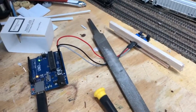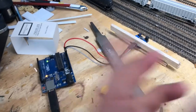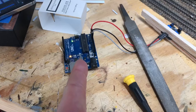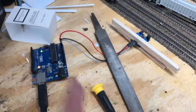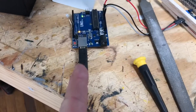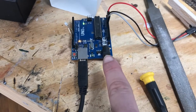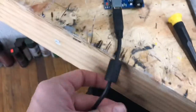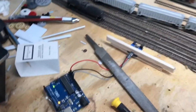That's the end of this video. The next video will be once I've mounted the sensor in the hidden area and tested it out. I'll need to mount the Arduino board near the sensor to keep cable runs short — three short cables rather than two long ones. For power I'm probably going to use a regular DC or AC plug rather than the USB extension, since extending USB is awkward. I'll see you in the next video.